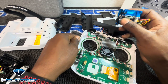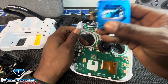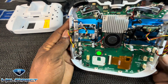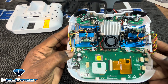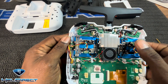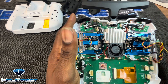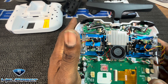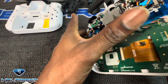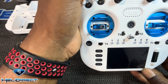This is my elevator and aileron — my right stick — so I'm going to install it on the left because it'll essentially function as my right. Just drop them in face down. It's fairly simple: you unplug the gimbals from both sides, the RGBs install here, and once you unscrew the four screws around the base you can lift them out. For the lights, you just have to figure out the correct orientation so they fit between the notches where the screws mount. They're in — I'll flip it over for a quick look and they look amazing.